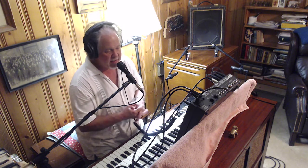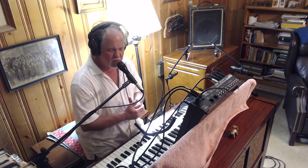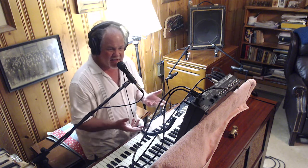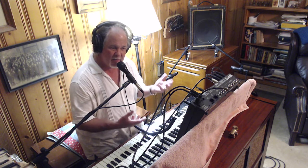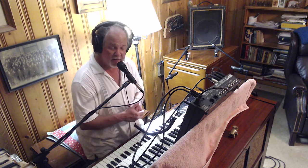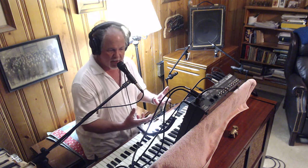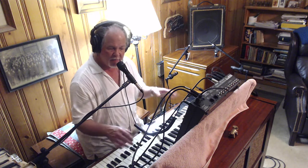And I put it on, I said, because it'd be nice to hear what the direct level sound from the tone generator is. You know, you have that option, a direct out, but it didn't sound good, obviously, because it takes its signal from the speakers, and that internal amp needed to be worked on. The electrolytics needed to be replaced, and it had some hum in it, just like the preamp had hum in it.